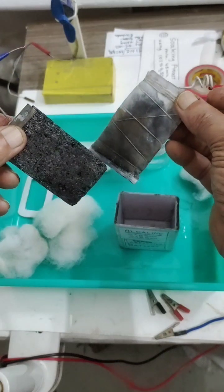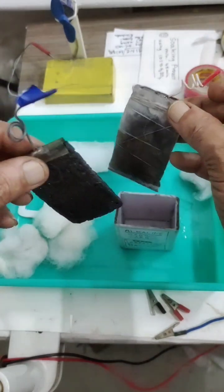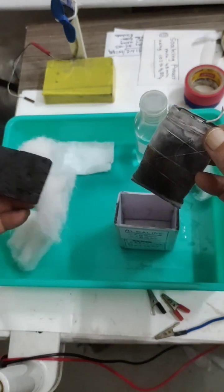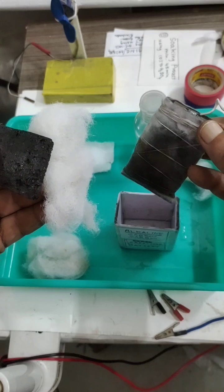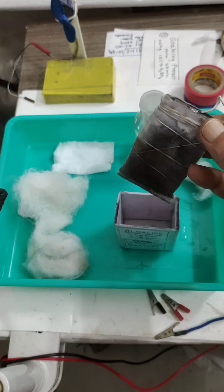No metals — no aluminium, no zinc, no copper sheet — so these will be our electrodes. In between I will be placing these polyester foams as a separator. Then I will fill it with 2N potassium hydroxide alkaline electrolyte, and that's all.